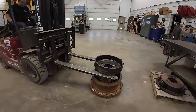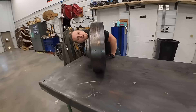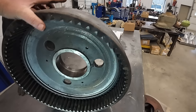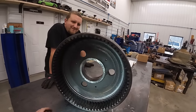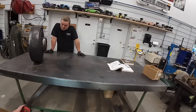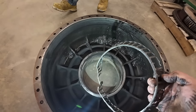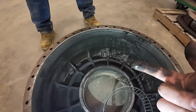It's like Jenga. Set that up there. There's a big snap ring. I was looking — this is actually two pieces. You can get this outer ring gear and this center section as two different things. So if you damage one, you can replace it. Fun fact about these final drives — they were made in Spain. Just like all Clint Eastwood's Spaghetti Western movies. That used to be a bearing cage. There used to be little round roller things in there. There they are — yummy. There's a couple.